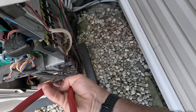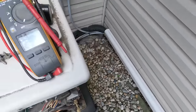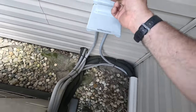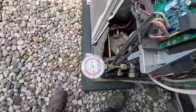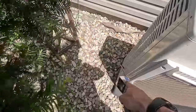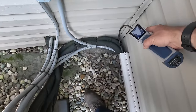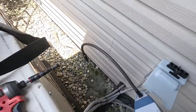You're mainly just dealing with low pressure, so we're going to have to go around checking all the heads. It's a 410A system so we can use the high pressure gauge. We're running 50 pounds. Let's see what happens if we kill that — see if the pressure will go up. There we go, that'll give us a little more pressure to work with. Hopefully we can find the leak a little easier that way. You can just tell because it's not coming back cold and it sounds noisy. They've got it kind of sealed up.